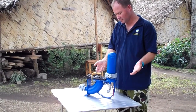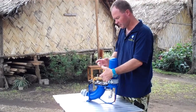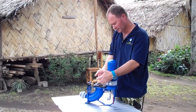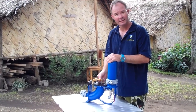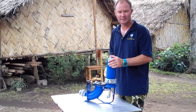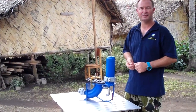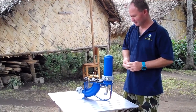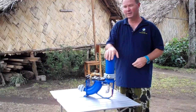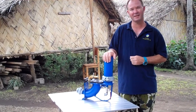Once that cycle is complete, the shock wave from the pulse bounces back up through the system, and then it sucks the delivery pulse valve back down again, and the whole cycle happens again. This cycle repeats around every 1.2 seconds, so every month this is pulsing about 2 million times — 24 million times a year.